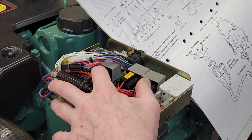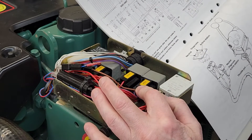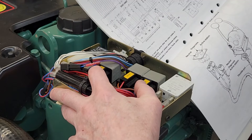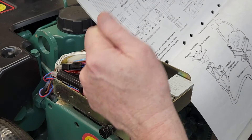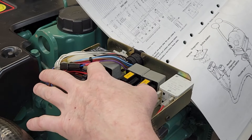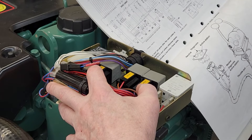When you turn the key off, that supplies power from the key switch down to the stop relay. It also supplies power to the ground relay. So simultaneously these two relays get power from the key switch when you turn it off and you hold it in the stop position — not just key off. You have to turn the key back against spring tension. That sends power to these two relays and it energizes them.